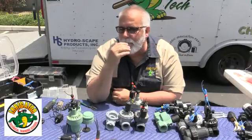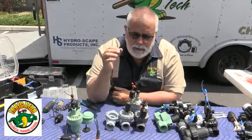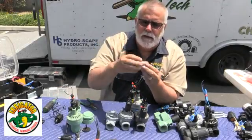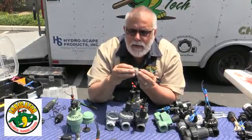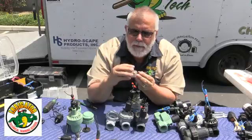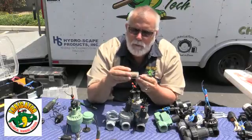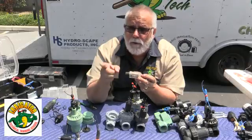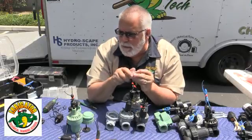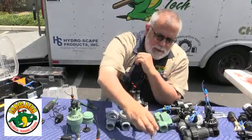So if you go into a store and they don't have what you're looking for and you can't find it on the internet, you can now interchange any of these solenoids and cross-reference them to the same one, which helps you a lot. What a solenoid is — it actually has a piece of metal and copper inside. The more copper that's in it, the more the magnet pulls up the plunger. It's a piece of metal they mold, and it's like a giant transformer. The wires come in, it's all soldered together, molded all in one piece. The more copper, the lower the readings, the farther you can run that valve, the better ohms reading you have. Every one of them, if they were clear, it's just a metal sleeve filled with copper, and that pulls the plunger up when it gets 24 volts.